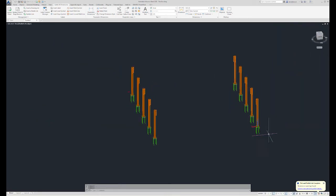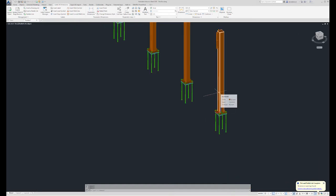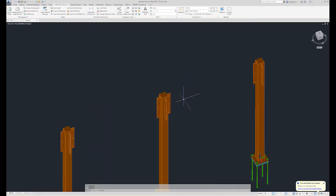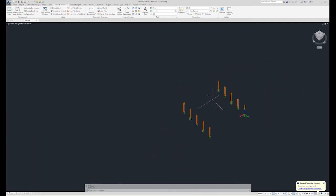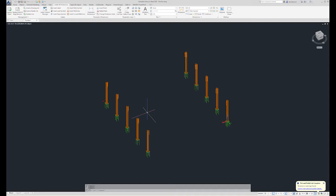So this is the first thing that would go in the project and be installed on site. We have the anchor bolt templates, the anchor bolts, base plates, the column that's constructed of an HSS, and as I was talking, each column has a little bit different configuration of shear tabs. This is an HSS 6x6 by 3/16, and then the exterior in the middle are 6x6 by quarter. So that's a good look at the first components, the columns, the start of the building.